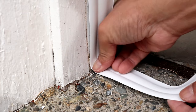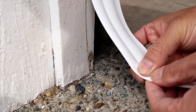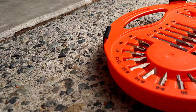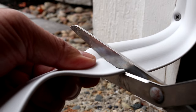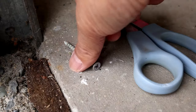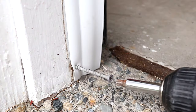Once the bottom is reached, just press the strip onto the ground to see where it needs to be cut. A pair of regular scissors will cut through this no problem. Then just repeat like before and install the last screw — it should sit snug against the concrete.